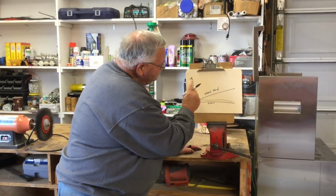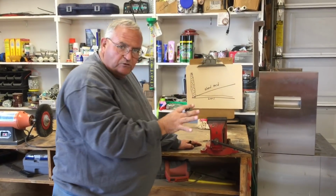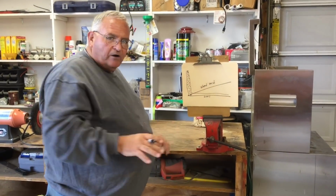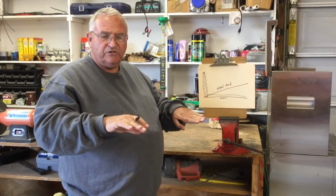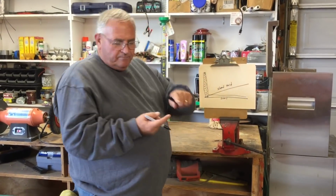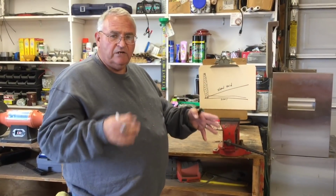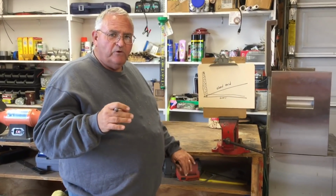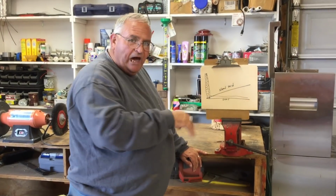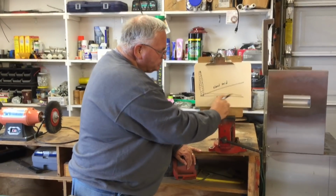So what you're doing is you've got a perforated pipe here that's covered with washed gravel so the water can get in. Because what happens is when you have an area like this, the water sits there and it just seals off the surface of the ground. So even if there's good drainage here, the water can't penetrate that top couple inches. Even here in my nursery, I've got really good soil that drains well, but we get into situations where that top 1 or 2 inches gets compacted, so we have to allow for the water to get below that compacted part where it can disperse and drain.